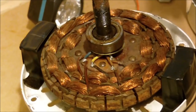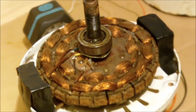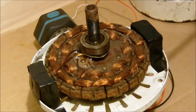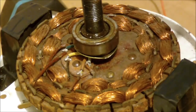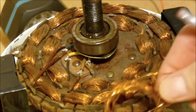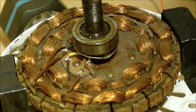The idea with this conversion is just to make a very simple conversion of a ceiling fan motor to a low RPM wind generator. Without unwinding all these coils and changing the configuration around, this is the easiest way to do this — just put the magnets onto the housing. I'm not sure if people are actually doing a conversion to the stator here, unwinding these coils and then wrapping in a thicker gauged wire.